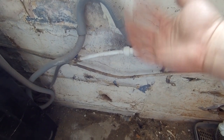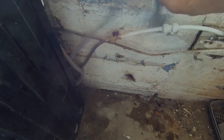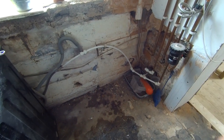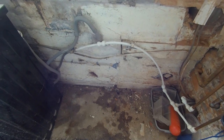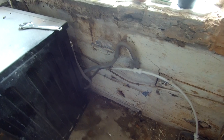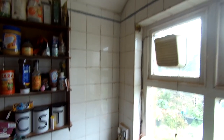All I need to do out here for now — this is where we had a tee piece going off for the tap, just put a straight in there, connecting up the washing machine still. Now all I need to do is get a piece of waste pipe for the waste, and I'm going to move the washing machine over to here for the moment. Look at the state of it behind here — this is why I want to clear this room and get it stripped out. All these tiles are coming off, polystyrene tiles off the ceiling — demolish it.